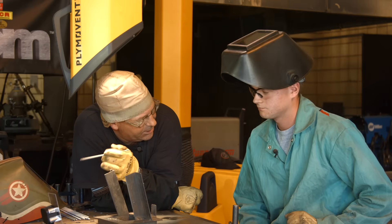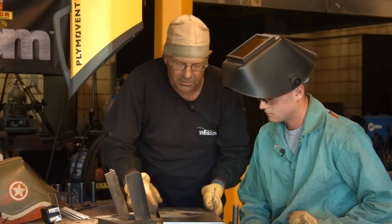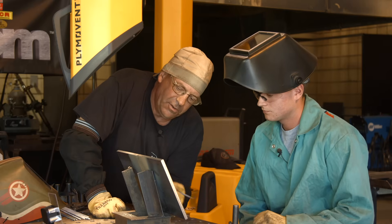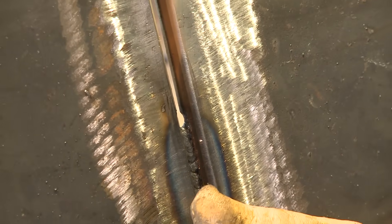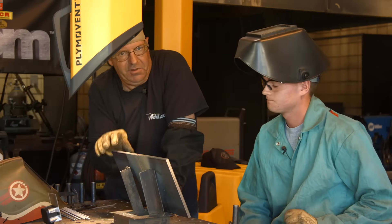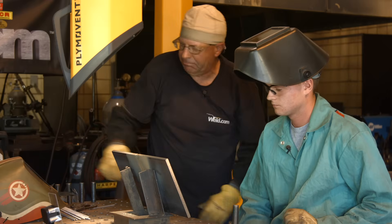It's cool when you get the right fit — and I think we have the right fit for uphill. I did turn you down five amps about right here, so this may have been a little hot for that gap. It's cool when you can just stick the rod and drag it up and not have to do a dance. The only thing you'd have to do is correct when the arc jumps to one side. The hard part is looking underneath the rod to watch your fill. When we re-strike this arc to continue on, where are we going to strike — up in the groove or down on the bead? Down on the bead. We strike, get the rod going, move up on that shelf and pause for just a second so that it can blend and weld, then we take off again. Do you want an amperage adjustment or leave it at 75? Probably leave it at 75. Remember, we have it turned up about 70% on that arc dig feature. All right, let's throw down.